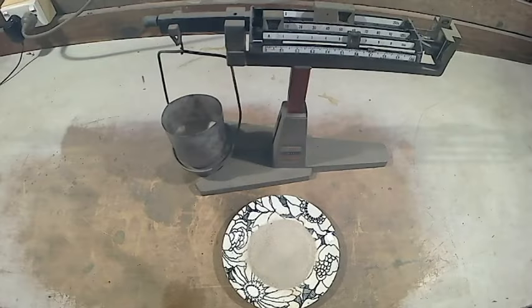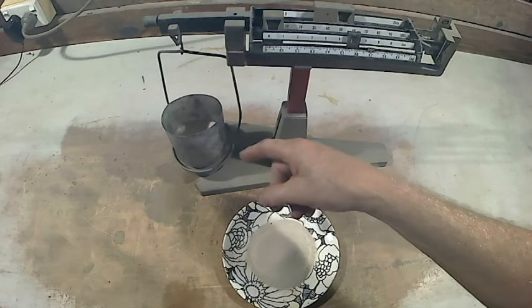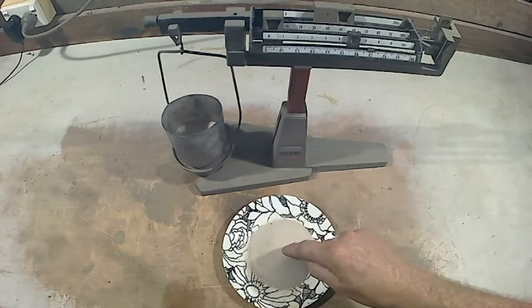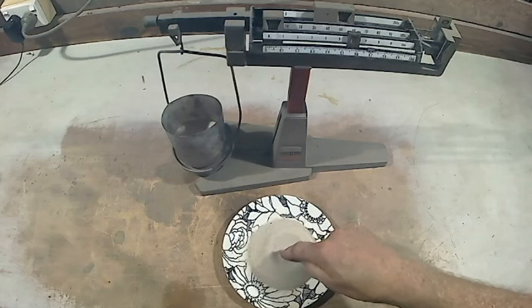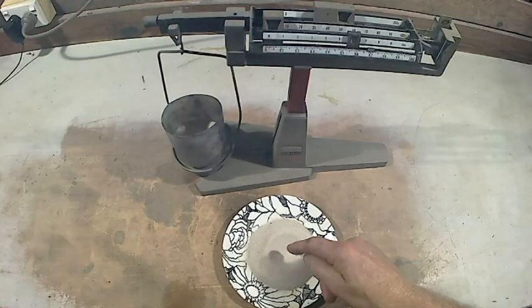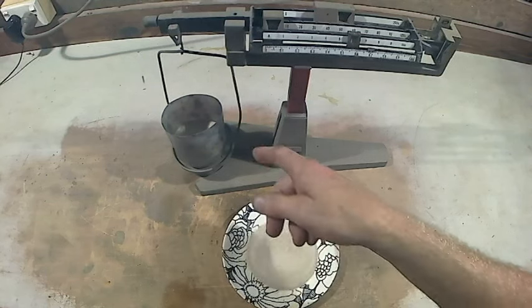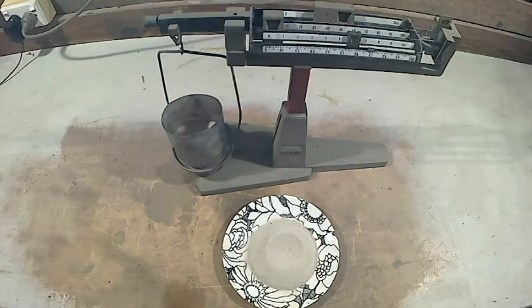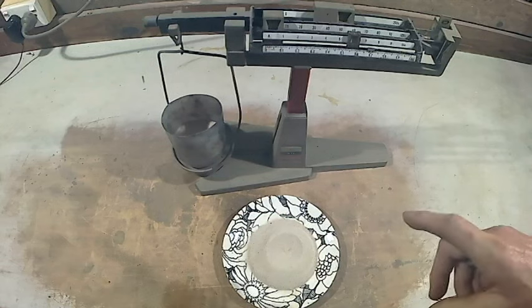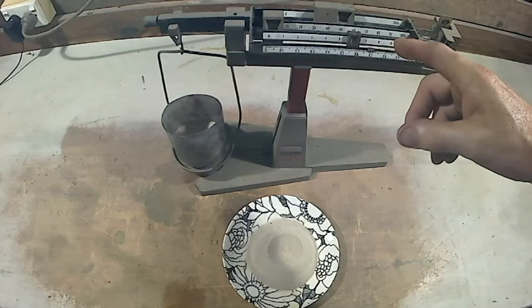This is the first core I'm going to mix some sand with. Before I do, I'll just show you the correct weight is in the little container there. So what I do is, in that container, I usually put a bit of a crater in there, so when I add the sodium silicate, it won't run to the sides and stick to everything, and you'll get a lesser amount. So I just have to add 3%, that is the target amount.